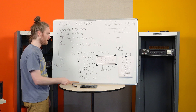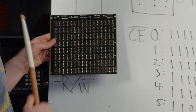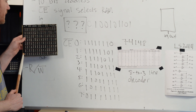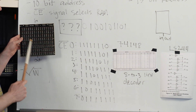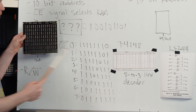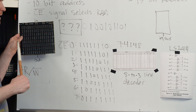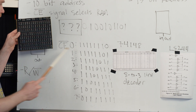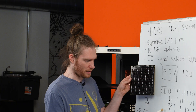First I need to explain the chip-enable circuit because it's pertinent to this problem. The EMT accesses each row of RAM individually at different times. The way it does that is it sends a low to the chip-enable pin of all the RAMs in a given row first. So those RAMs have a 0 on their chip-enables while the rest have 1s. Each 1 represents a row of RAMs while the lone 0 represents the active row. The computer then increments the chip-enable so we're accessing the second row, and it's going to do that a total of 8 times.